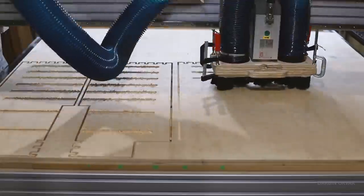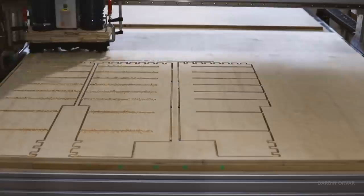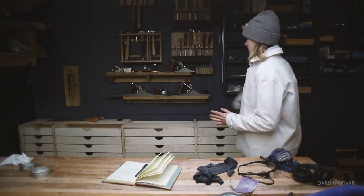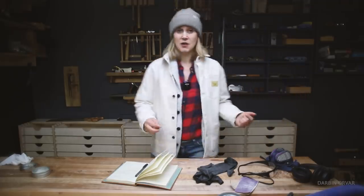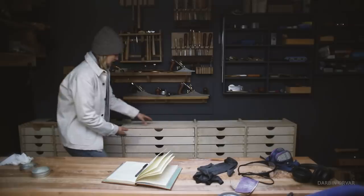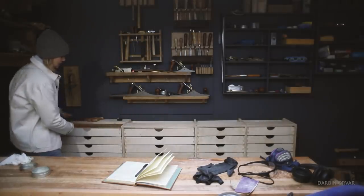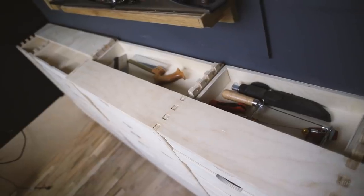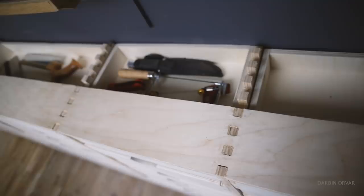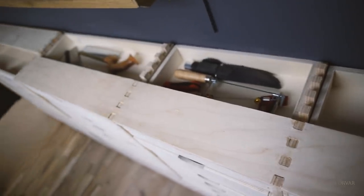The first challenge was how to connect the pieces together. This unit is eight feet long but the plywood is five feet long, so I couldn't put one sheet across. Instead I cut it in half and had one section here and one section here. I was able to do this with only one divider rather than the usual two, since the plywood can still rest properly.